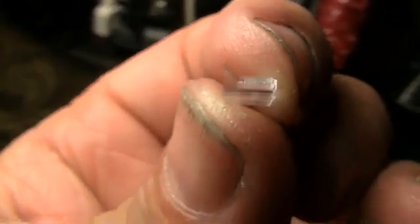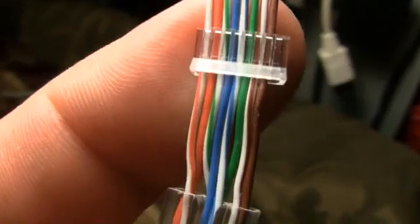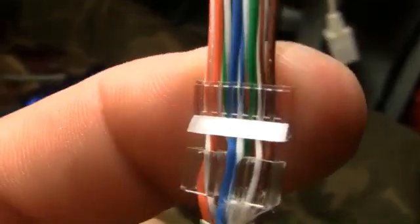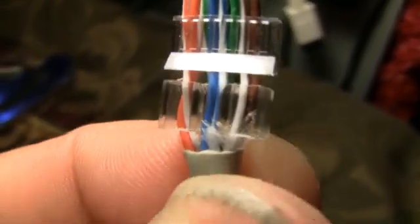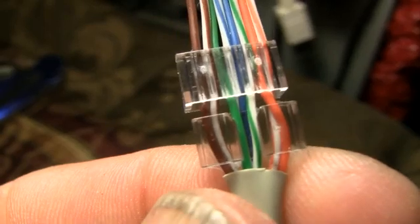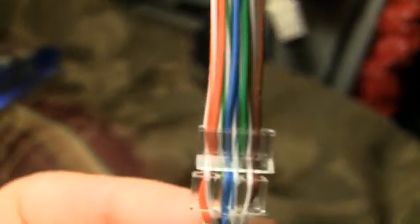See how that little cliff there is on the left-hand side — that's on the cut side. That's how it goes on. Slide it right down there. This is where those extra gaps come into play. The blue is allowed to separate and the green has actually split right there — that's why you need the extra taper where it's wider on the green. I'll cut that flush, then we'll jam it into the connector.